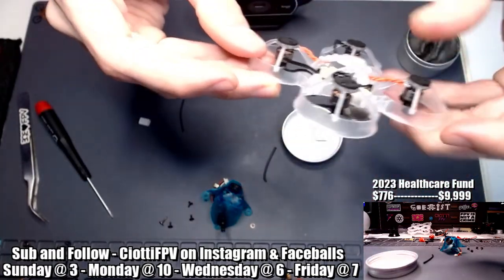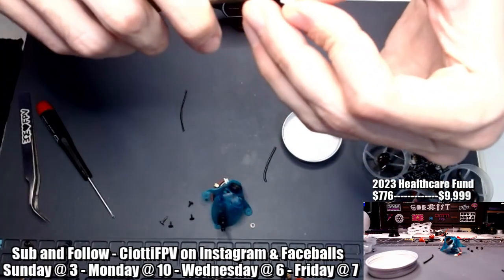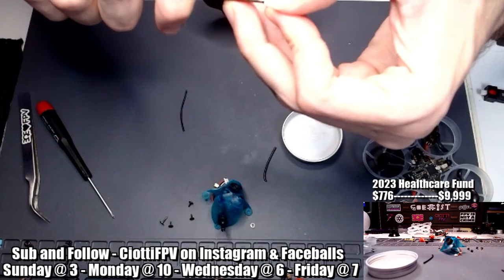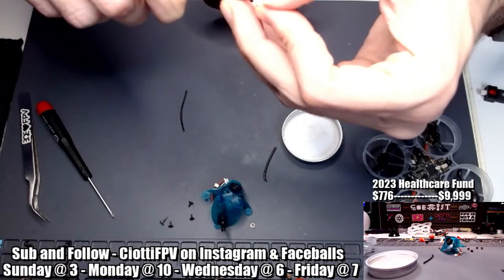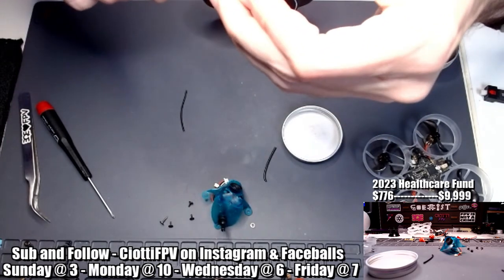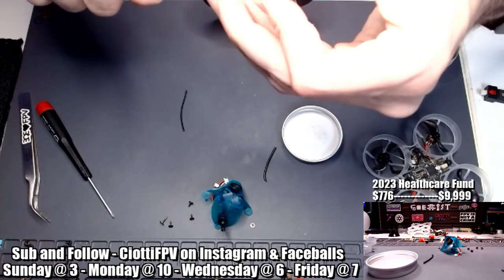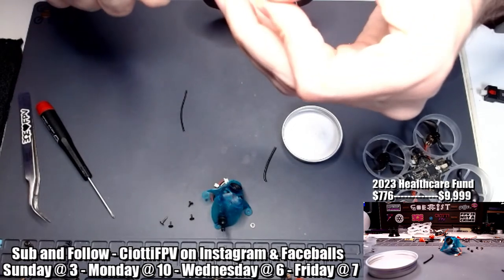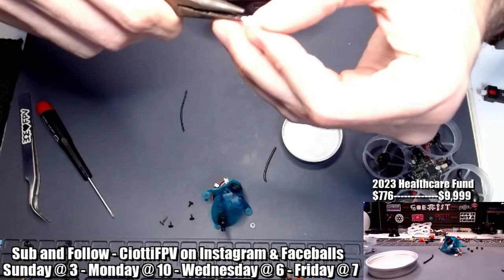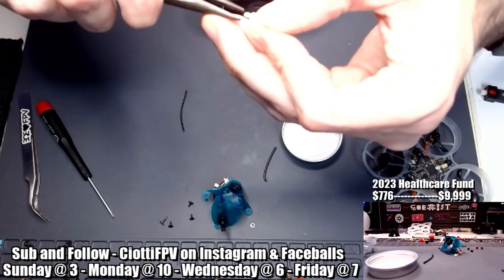I know it seems insane, but it actually does matter with tiny whoops. The length of it actually matters on all rigs. The battery wires are pretty thick gauge, and they're pretty damn heavy. So shortening them up can actually give you a little boost in performance by saving weight. On like a 5-inch rig, you can save like 5 or 6 grams doing that. And that's a real weight savings there. If you can find 2 or 3 or 4 different things that save 5 or 6 grams, that's really significant.